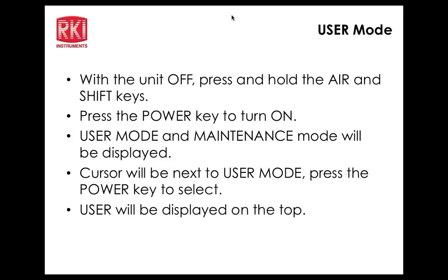Now, here's something I want you guys to definitely remember because it's pretty important. You can enter factory mode also from maintenance mode, or from the maintenance label, I should say. What mode you go into depends upon what password number you put in. Okay, so 0006 will get you into maintenance mode, and 1994 will get you into factory mode. But we'll go into maintenance mode first. So right now it's set up for the back door 006. Let's move that over.